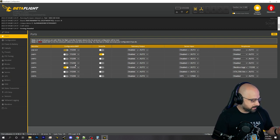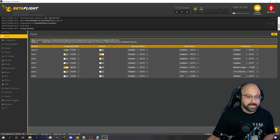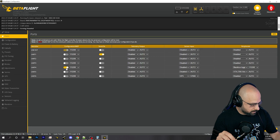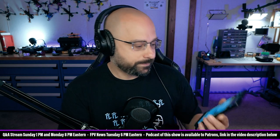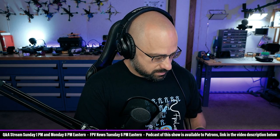Mamba Stack, Wi-Fi connected. Going over to Speedybee. Hello, Speedybee, where are you? Internet may not be available. Connect only this time. Hey, no kidding. Hello, Speedybee, there you are. Initializing, yeah, it worked. So it's UART 4. You need MSP enabled on UART 4. And here it is, it's working. You can see right here, it's totally working over Wi-Fi. So just manually connect to the Wi-Fi network, and then in Speedybee, just connect. Bada bing, bada boom. That's how it should work.